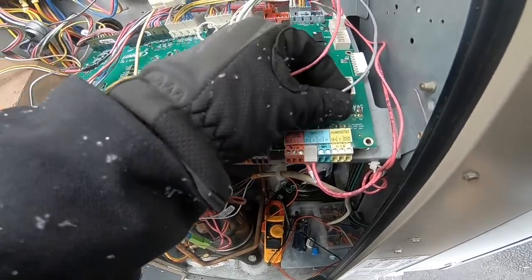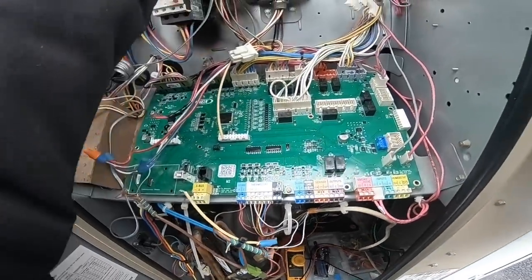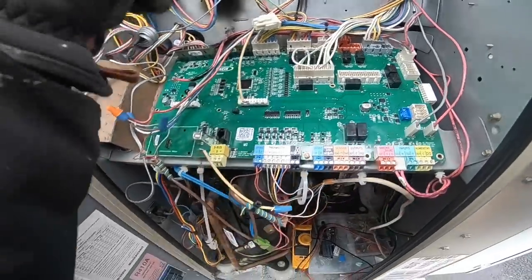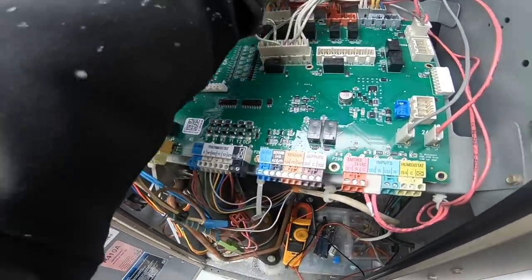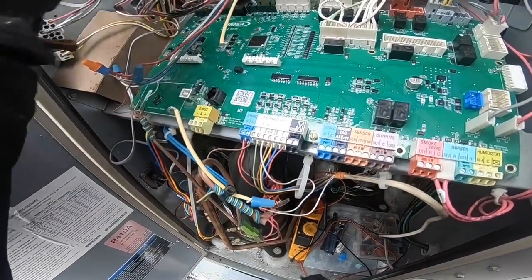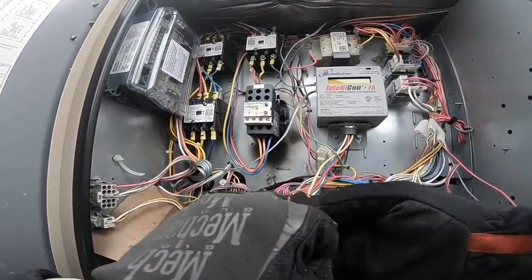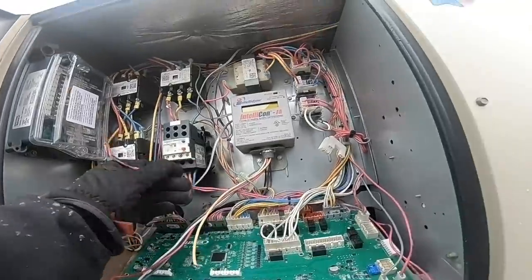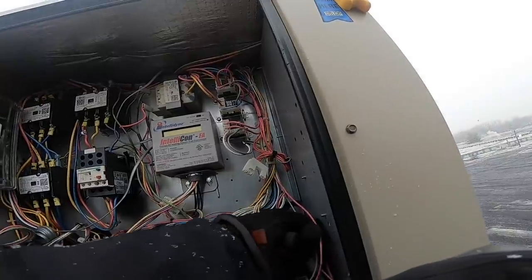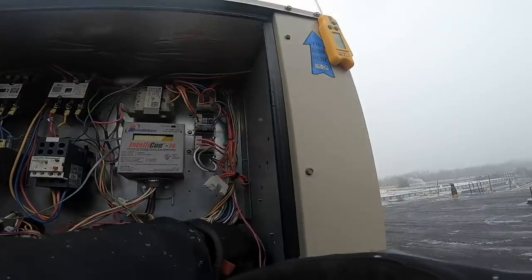This is common, 24, back on the transformer. Okay, this was just hanging out, didn't have a plug to go to. These wires get connected into here, these wires I gotta connect back in, these are arcing on the casing. I can cut a little bit of the wire off. Reroute it. Let's see if I can gain a little bit. If I can make it a little longer.